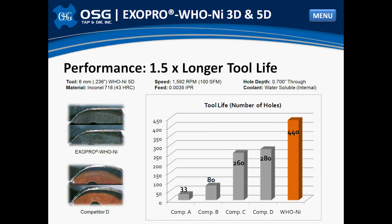Performance Overview. Here we have in-house development results. We tested versus all major manufacturers with their preferred drill for heat-resistant alloys. The results are very telling — long tool life, almost 500 holes in hardened Inconel 718, and only moderate, predictable wear rather than chipping or breakage.